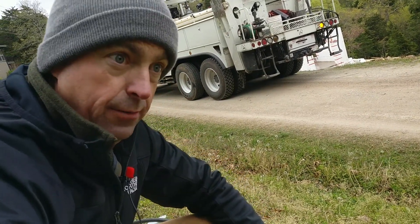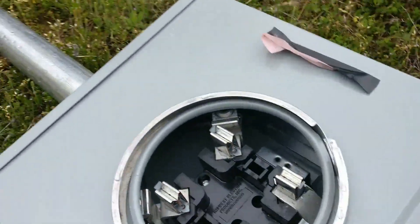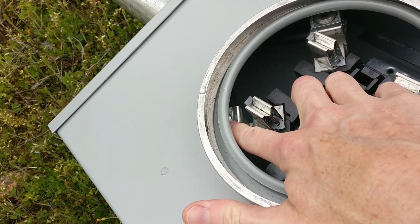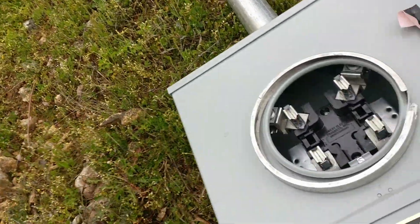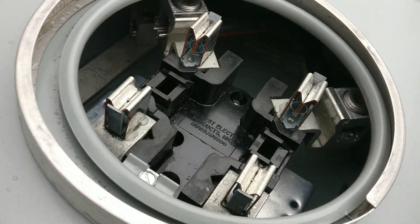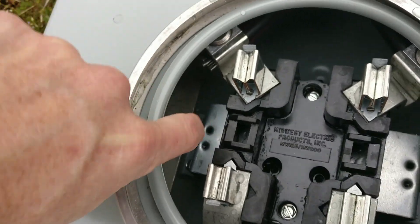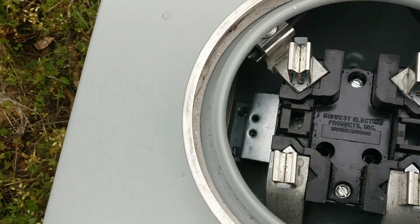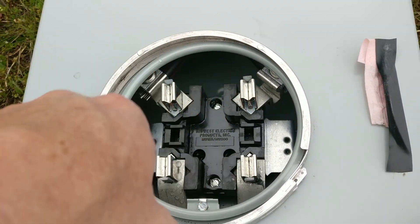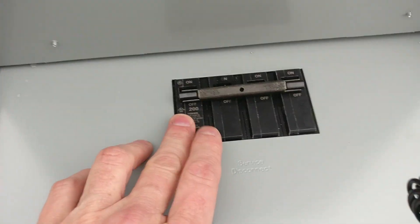Let's go down to the other end. I wish I had the box open to show you — the pieces terminate right in here, and this is where the meter goes. You can see one wire hooks in right there and that other wire hooks in right there — those are my two hots. And the grounded one will be way back in there. You can just kind of see the edge of it — there's a bar that goes down, that's where that one is separate, and that's where the grounding comes from. It'll come in from the pole, this is where the meter sets in and meters how much electricity we have, and it goes out into my 200-amp breaker.